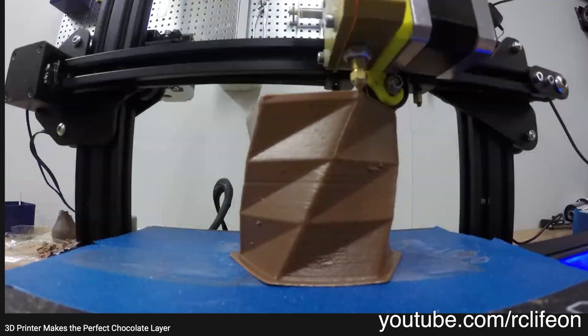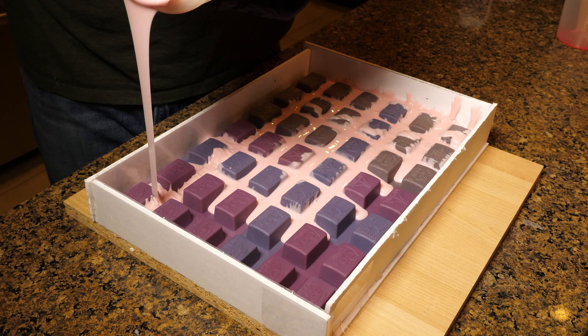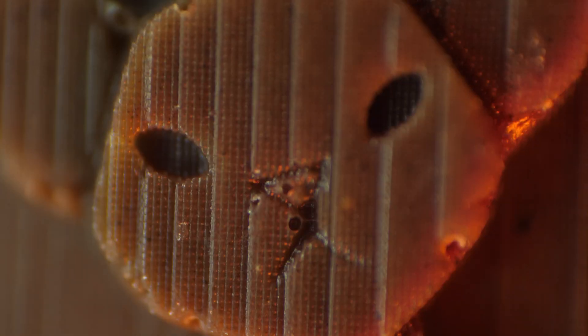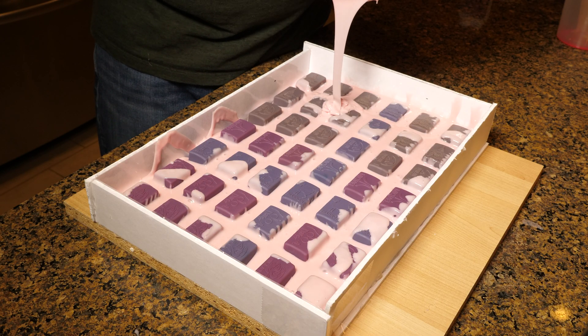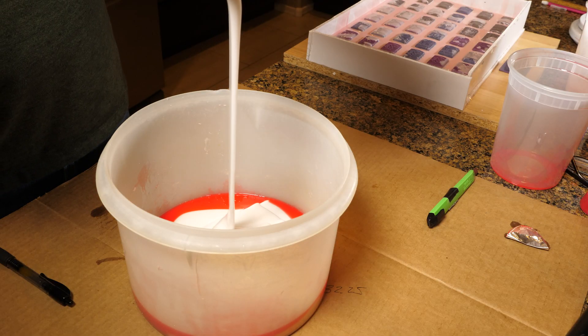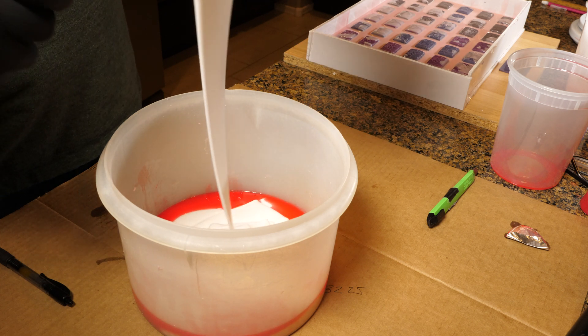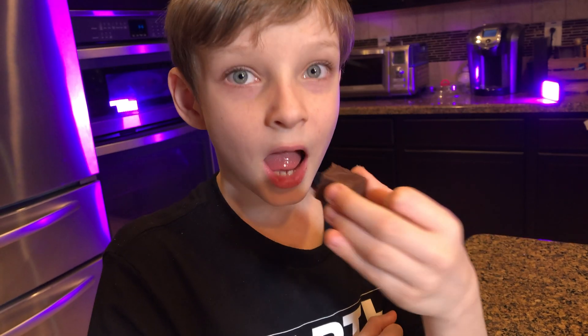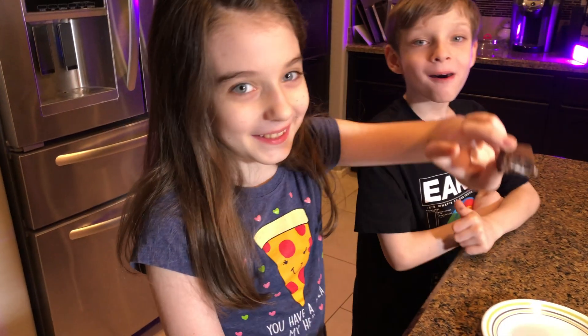We also made some s'mores bark and some haystacks to fill out the rest of the box. I started off this video wanting to 3D print chocolates. And while with a resin printer I couldn't do it directly, I did the next best thing. The silicone captures the 3D print detail perfectly — you can see the print lines and the voxels replicated in the chocolates just as they were on the original 3D printed masters, and I think that's pretty cool. I'm going to be sending a box of chocolates to Robert as thanks for helping me out. I expected the mold making to be the more difficult part, but really it was no problem. The Smooth-On food safe silicone worked really well — it was thick and a little difficult to work with, but the result is pretty flawless. And of course, the chocolates are fun to eat. See you next time.